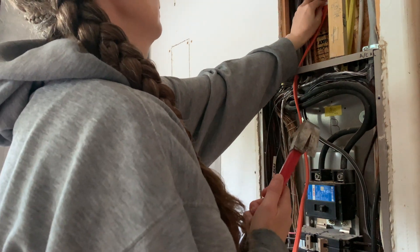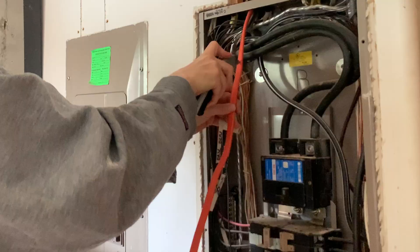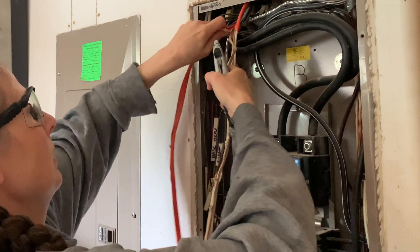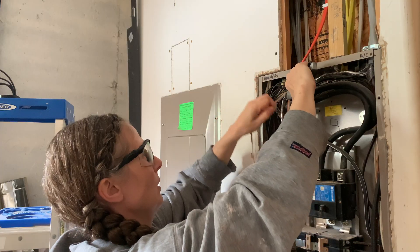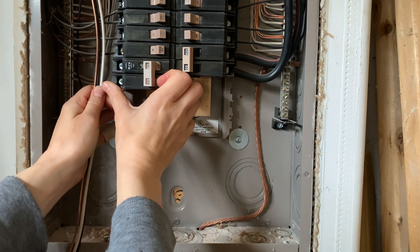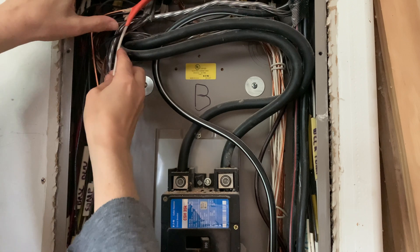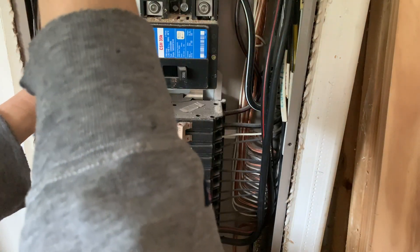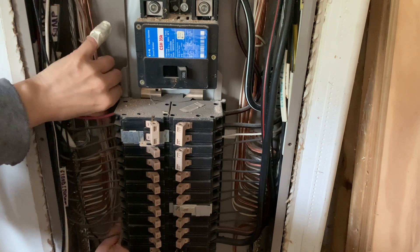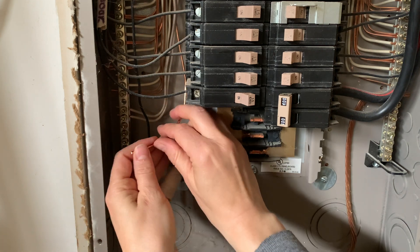I secure the wire above the box, which again is dictated by local code. Once the wire is in the main panel, I'll use a utility knife to remove the protective sheathing. I like to keep an inch to an inch and a half of sheathing at the top. This is the 20 amp breaker we're going to install. I like to place the breaker in position first and then make sure the wires are going to run correctly. Then just to keep the box tidy, I'll bend the wires up in the corner following along with other wires. In this box, the ground wires are run behind all of the live wires, so I followed suit and placed my ground wire to the back of the box. The ground wire will go on the ground neutral bar — it's just inserted through a small hole and then secured in place.